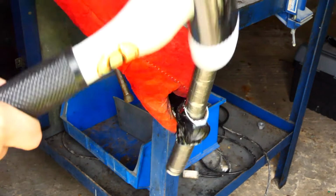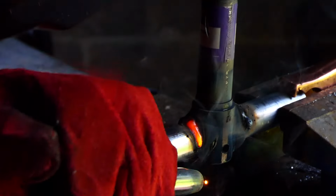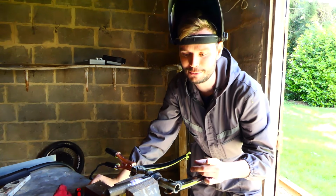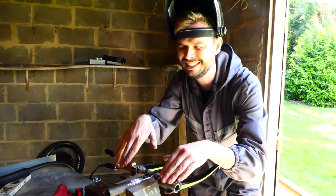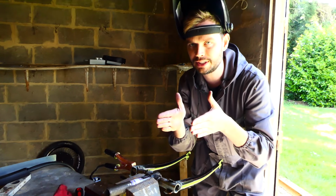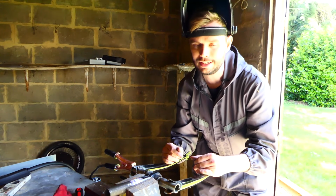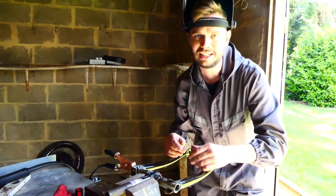After breaking my notcher, hacking away with a hole saw, and some questionable welding, they were just about complete. So I've had a bit of a nightmare trying to get them straight, and you're not allowed to look here, still hot, or here. Because they were on a bit of a taper themselves, when I put the hole saw through without my notching device, it didn't go straight. So when I mounted it onto the actual forks, it was bad.